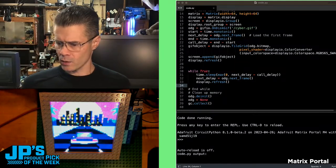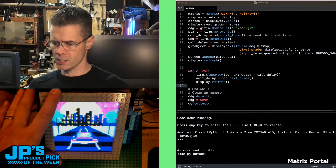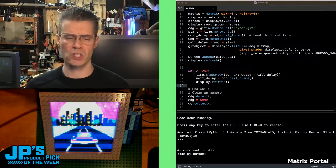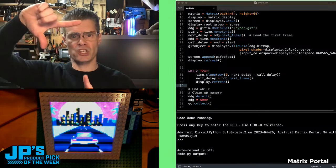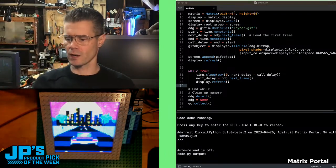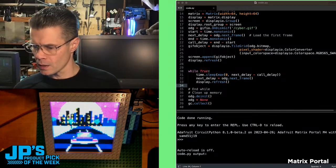Yeah, Wet Willie, the question was, this is Adafruit's CircuitPython GIF support. It is, not Expressive Pixels, but that's another option. There's a Learn guide on that. I haven't looked at that, but yeah, we have a couple of different ways to do those, as well as just sprite sheet animation. So a sprite sheet that has one long or wide image, and then the code can, just like on a video game sprite sheet, page through those quickly.